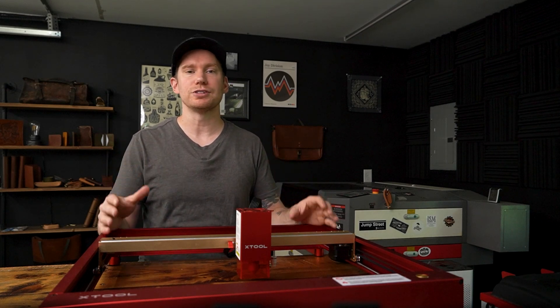So let's talk about the things I like. Number one: the D1 Pro just worked. I operate in a pretty chaotic fashion when testing and prepping for laser jobs — I start jobs, stop them 15 seconds later, grab the laser head, move it to a new spot, defocus, refocus, run the job again. There is nothing worse than your laser losing connection to your software, a job timing out, or the laser not respecting your job origin. The D1 Pro did none of that. I installed Creative Space, connected over USB and Wi-Fi, and it just worked. I installed the D1 Pro in Lightburn, and it just worked. First time. I've put several days worth of time into this machine and it never skipped a beat — I can't tell you how much I appreciate that, because it's often not the case with these diode lasers.